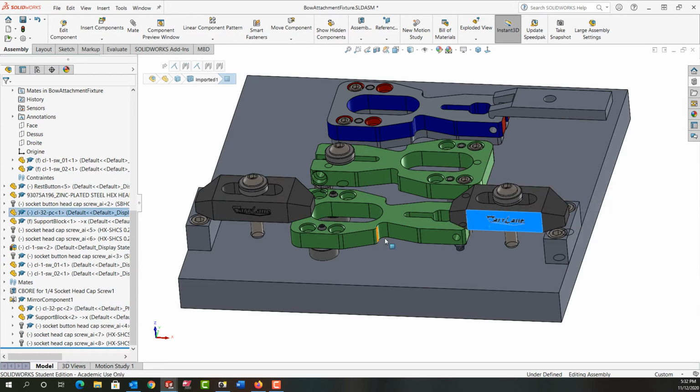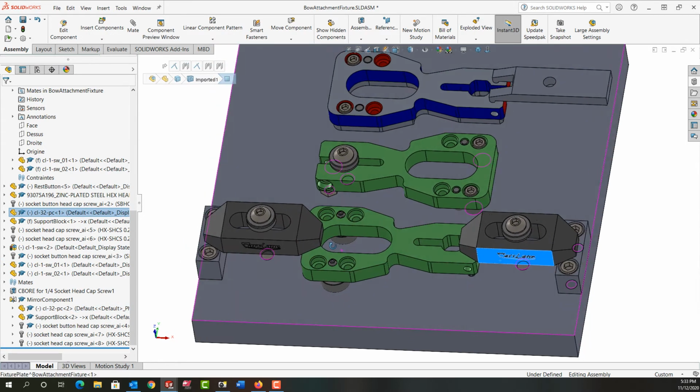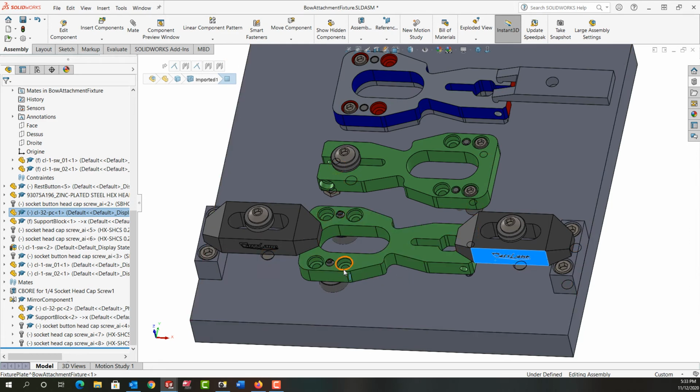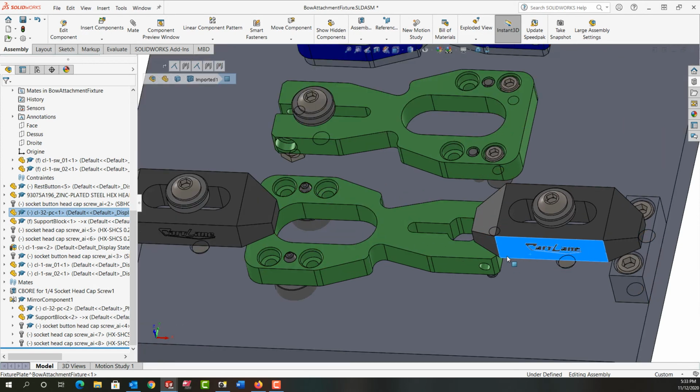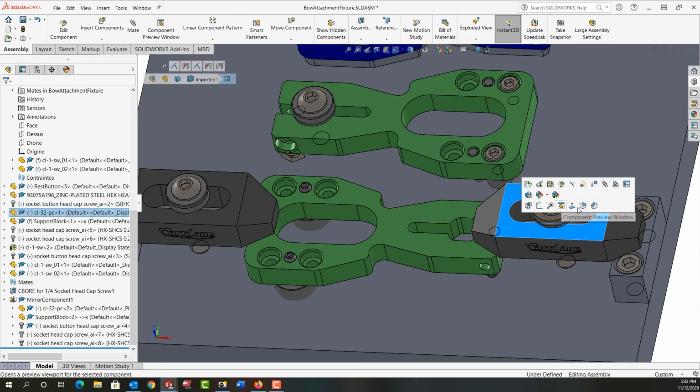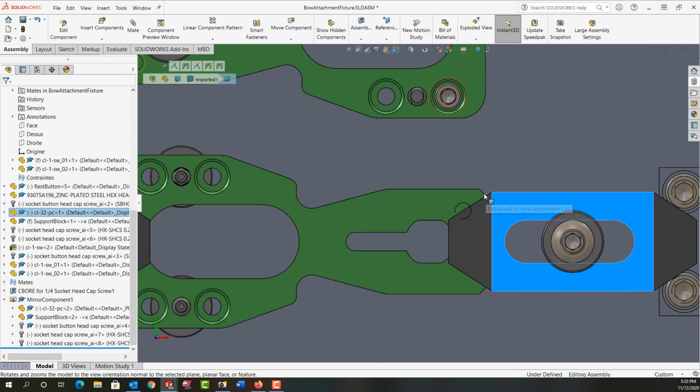And we could put two strap clamps on this part and still mill the inside pocket and the outside profiles. But again, as we see here, these strap clamps are pushing the limit as is. This needs to be slid back to stay out of the way. And the other issue we have, if we just look normal to this view, is we're going to have a really hard time still machining this edge in this setup.